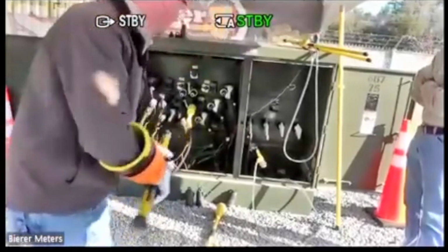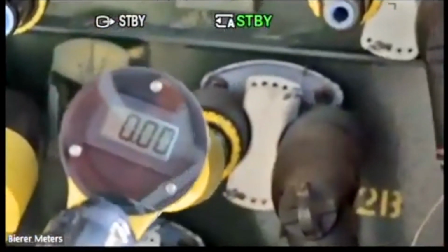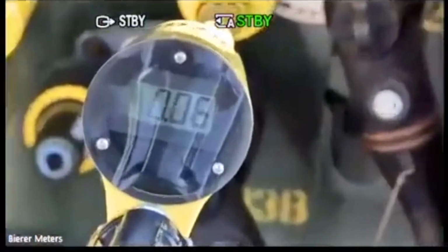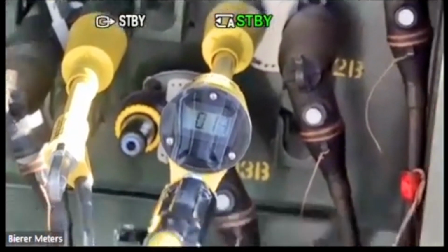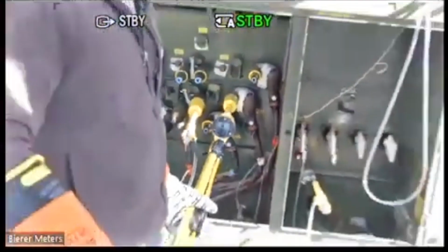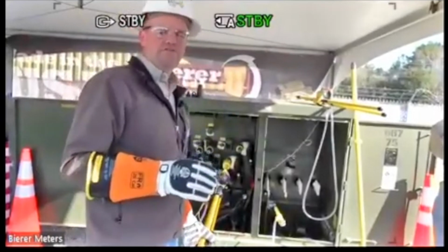Okay. Then I want to take this meter probe again and put it on my source. And I'll get Ryan to kind of focus in on this housing before I insert it, just so you see that number jump up. Ready? See that number jump up? So it jumped up around 5 kV, almost 6 kV, and there it goes right back down to near 0. Okay. So you see that potential being inserted into that de-energized cable, and you should see that number bleed off.